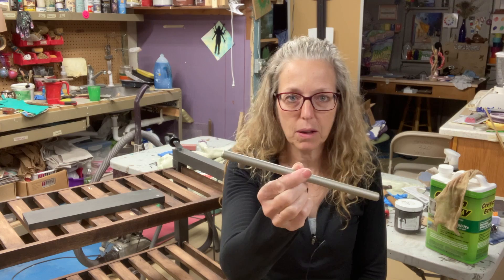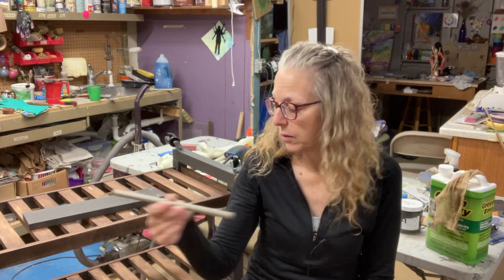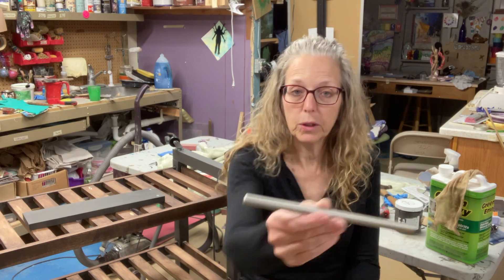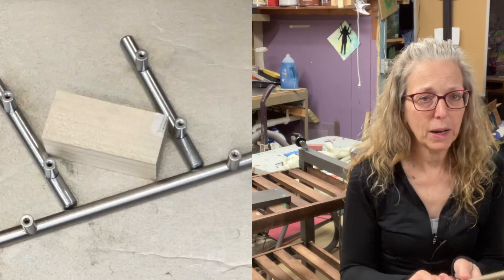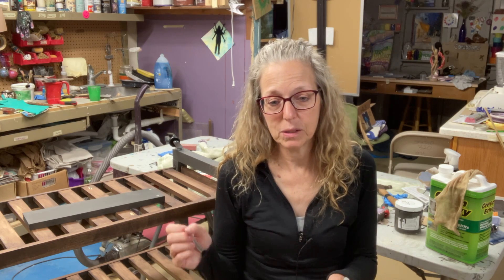A little note about the hardware — I got this hardware and it wasn't this color; it was like a brushed nickel. I have these and the drawer pulls. These are for the ends to hang towels on and to push the cart around. I'm using a satin nickel and champagne mist, which is one of my faves — it gives it a real nice color. When I was spraying the satin nickel, the silver color was spitting — it was at the end of the can, spitting out blobs — so I had to wipe it off and do it again.